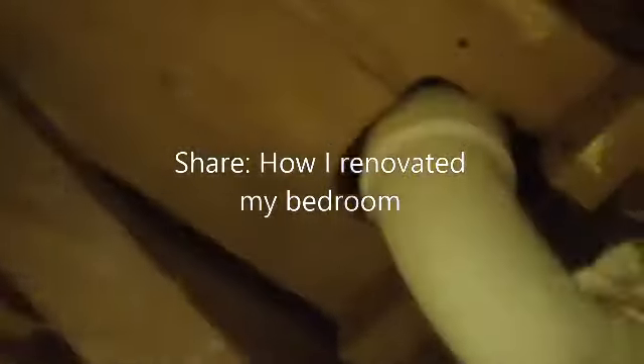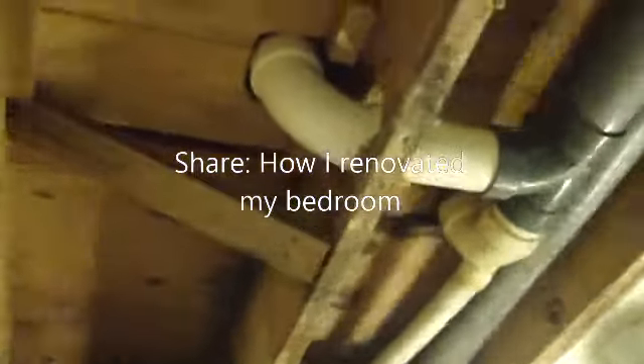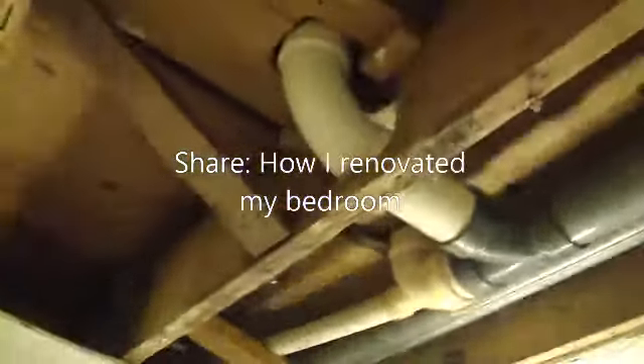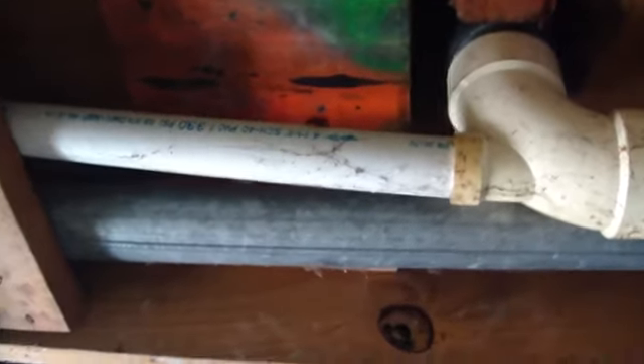As you can see, the water had been sitting there for a while — it's rotted. Here's the first repair from the leaky toilet. I reinforced it with like a 3/4 inch plywood and then placed that there. I had to take the fan off. There were some colored boards sitting in the garage that saved some money — they're 3/4 inch. I cut those out and reinforced the rotted portions of the boards. You could actually stand on the second floor and bounce a little bit, and you could see it down here bending, so I thought best that I better reinforce it.